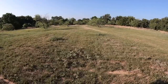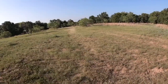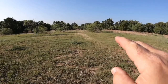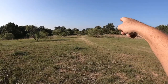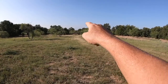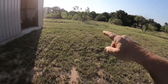The other option was to take it off a pole on my neighbor's property — you can barely see it in there. He said, 'Here's what I would do if it was mine.' There's a decent opening through here, and we'd have to take a few mesquite trees out. We can come off that pole, come out 30 feet, drop a pole, stake it with guy wires, bring it all the way up to about where that mesquite bush is, put another pole, and then come from there all the way to this back corner underground in three-inch PVC.